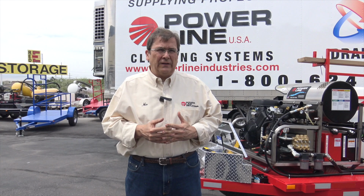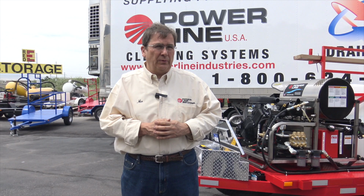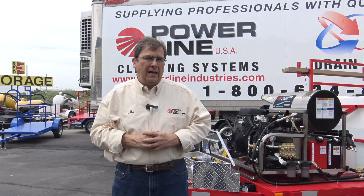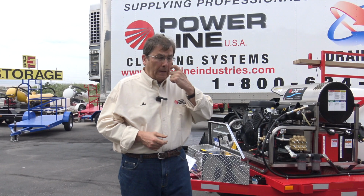Always wear your personal protective equipment, PPE, and the recommended PPE for this equipment is heavy duty gloves, glasses and or a face shield, maybe a hard hat if you're in that kind of an area, some sort of boot protection and good heavy duty clothes. Some people wear rain protection, which is fine because you're going to get wet when you're washing. You get splashback on you. We have full safety operational sheets that come with your machine.